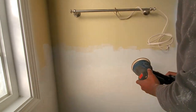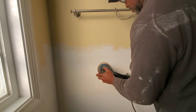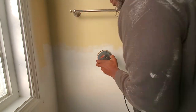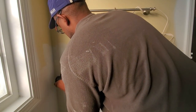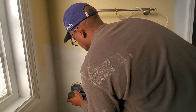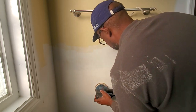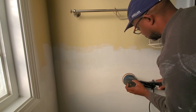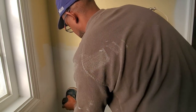I'm going to start on this wall — the second wall where I didn't show the drywall installation in the previous video. I'm just making small circles. I'm letting the sander do the work; it's very fine finishing work. If you look closely, what appears to be paint on the wall is actually drywall primer — that's why the boards are no longer green. Drywall primer is different from standard primer because it allows you to still sand it after it dries, whereas regular primer can curl up and make a mess.